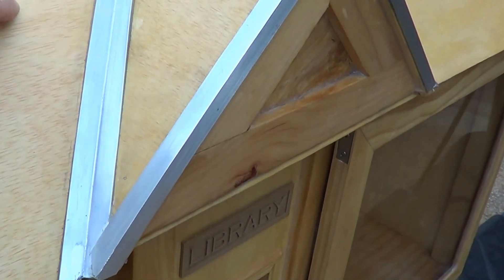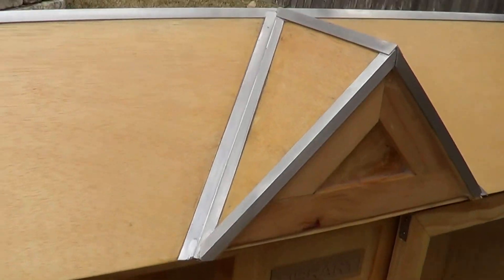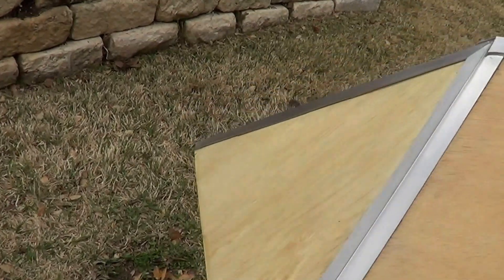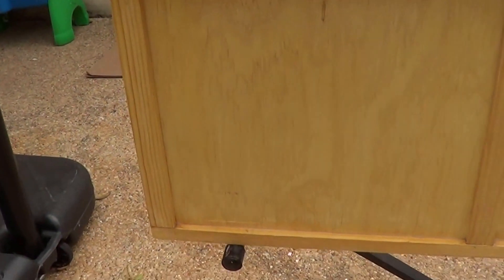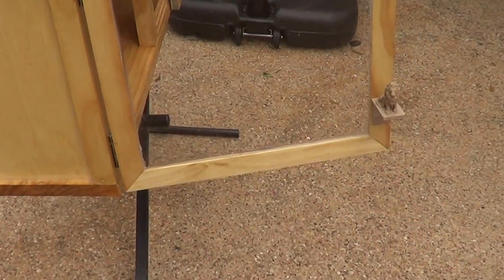I patched the nail holes and thought I sanded them out, but they kind of spread out, and when I put the finish on top of them they really stuck out a bit. I'm not really sure what to do about that long-term. I was thinking maybe if you put the first coat of varnish down, then fill the holes, the wood would have at least one seal — or just not use finishing nails at all, though that means more work clamping things up. I varnished this in the evenings after work and I was a little shocked this weekend when I realized I had drips and stuff I didn't see. A strong work light would be much more preferable.